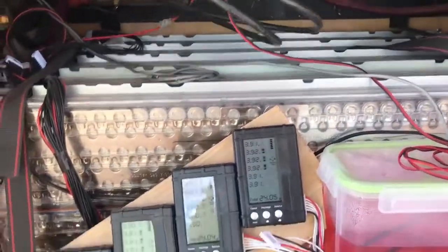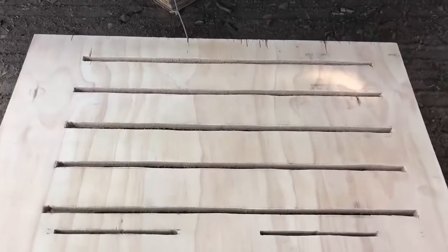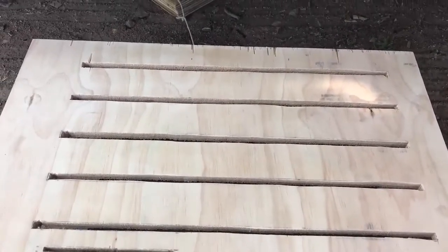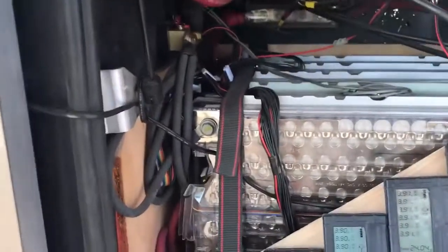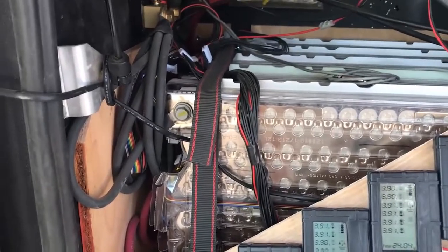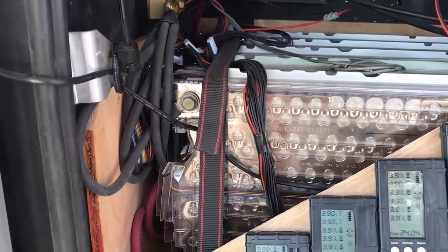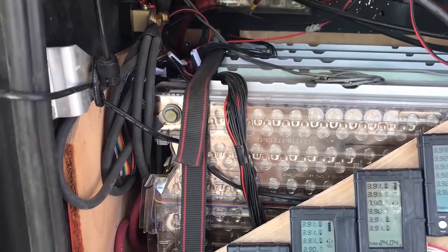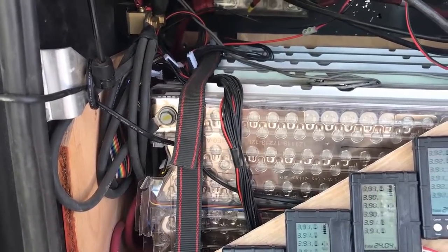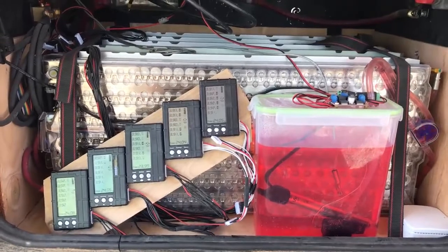It's not the temperature of the batteries themselves — it's actually a little colder than the batteries — and that's how we measure the 10 to 20 degrees above freezing. The modules have an edge on each side that makes mounting quite easy. We created a board underneath and cut some grooves where the edge fits down in, which prevents them from sliding forward and backward. By having straps that go underneath the board and then above the batteries, we tie them down very well. At 270 pounds or so, it should easily hold down when rattling around on the road.